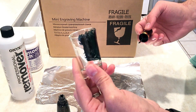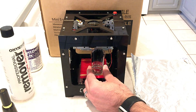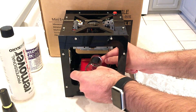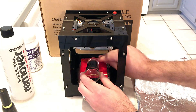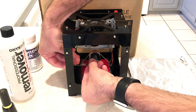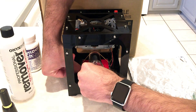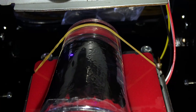Once we've done that, we place the glass into the laser etching machine, making sure that we put the small end at the back. Otherwise the large end gets in the way of the machinery and the etching won't work properly. So I turn it around and put it in like this. Once it's fixed into place, I like to use a little Scotch tape to help hold it down — it gives me more control over where it's sitting than just the rubber bands, especially when it's something round like a glass. And then we start etching.